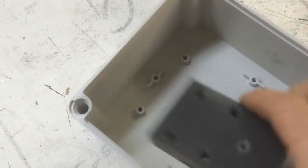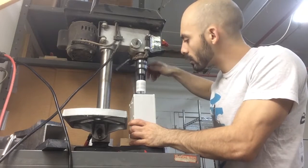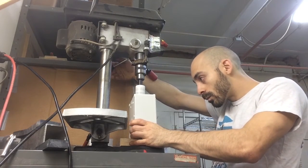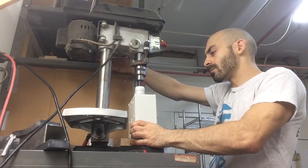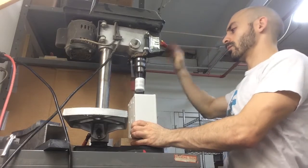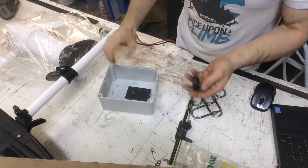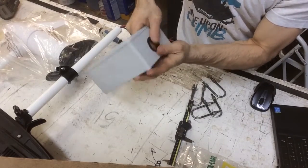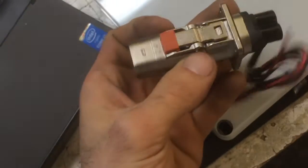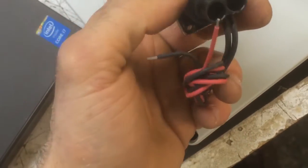Here's our now not-so-simple box taking shape. There's a piece of PVC that goes here, and this pipe is going to go through a hole at the bottom of this box. This is a grommet and it goes in here and makes the hole look even more professional. Here's the connector we're going to install that's going to allow us to unplug the whole thruster unit from the vehicle. We have to drill a shape to allow us to mount this here.